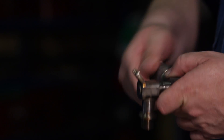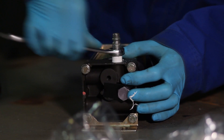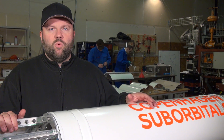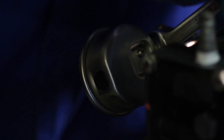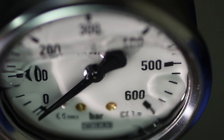We expect to have around 300 bars of helium in that tank when we launch, so we need to pressure test it at an additional safety factor of around 1.5, just to make sure the tank won't blow up on us at the launch pad. Filling it up with water and pressurizing with water means that if the tank should rupture, it will just make a loud bang and spill some water — it won't send parts flying around with pressure waves, as would happen if pressurized with atmospheric air. So we always pressurize with water.